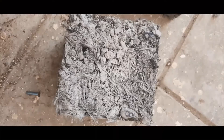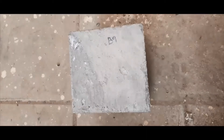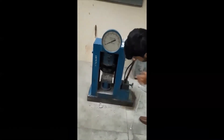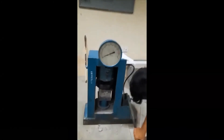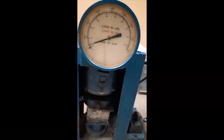They will perform compression testing in the compression testing machine. You can see in this picture how well it is mixed with no gaps. The first cube is conventional concrete and the other two contain polypropylene fibers. Students are now performing the compression test on the freshly cast cubes.